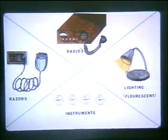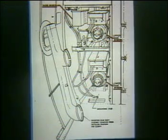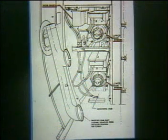Alternating current is required in the DC-6 for the operation of the radios, the automatic pilot, certain instruments, and some lighting equipment. These items require approximately 1,200 watts of 115 volt AC three-phase power. The single-phase 60 cycle 110 volt AC from the razor inverter produces approximately 80 watts of power to operate the electric shaver receptacles in the blue room only.